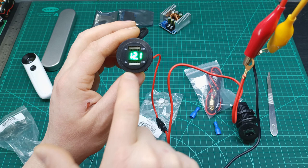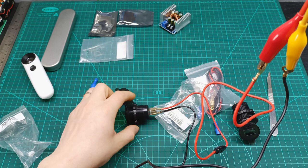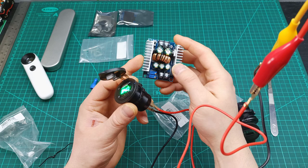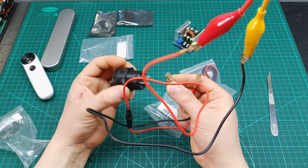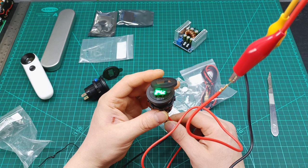Let me now try powering with 24V, because I'm going to do a 24V solar system. I increased the voltage to 24V — actually 24.6V, let me reduce slightly — and it looks like it's working with 24V as well. I hope it doesn't get hot. That's why I also got the buck converter — to step down from 24V to 12V, then power these two USB charger items from that. I'll figure out the exact configuration. Stay tuned — please subscribe and activate the notification bell, because soon we're going to travel to the Philippines and I'll do this project.